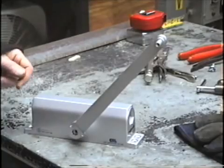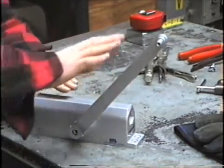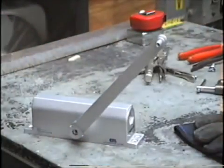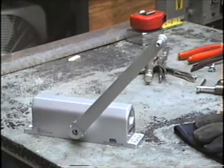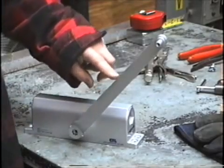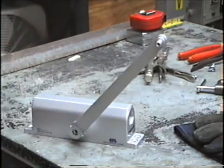For the foot pedal part of the door opener I'm going to use one of these pneumatic cylinders intended for door closers. The foot will go here and push the lever down, then release slowly. There's an adjustment on the end so I can control the release time to ensure the furnace door doesn't slam but closes slowly. The first thing I'm going to do is weld an additional length of bar onto this because right now it only has about an 8-inch throw and that's not enough — I want to be able to open the furnace door more than 8 inches if I need to.